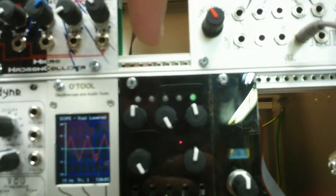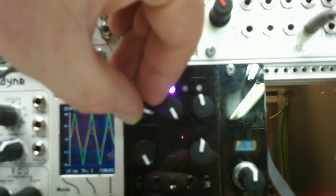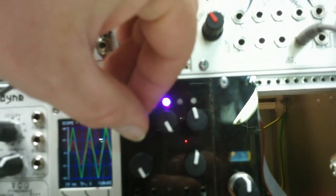So there's unity at halfway, and it's off with crossfade off. That's clipping. There's a 5-volt peak-to-peak input signal — clips right there, and well, really clips there, but here's the threshold of clipping.